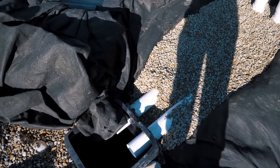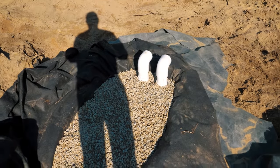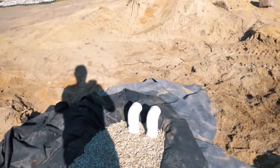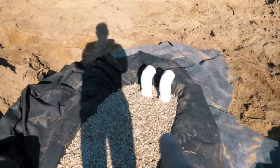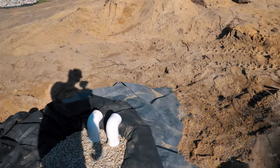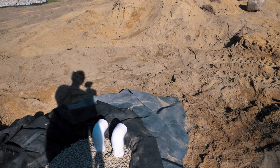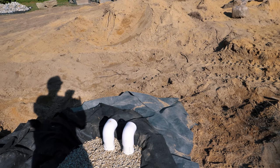This is going to be using external pumps — we have two EXT 12,000 pumps running the system, so we've got to draw the water from in here. We want to use hard pipe because on suction you could actually collapse flexible pipe, so use hard pipe to avoid that. The reason we're putting check valves in here is because we have to actually prime these pumps — I'll get into that tomorrow. You can kind of see what the inner workings look like. We're bringing our pipes out, stepping up, and getting above our water line in the pond. Tomorrow I'm going to put a few blocks underneath there, four inches above water, so there's no chance of any settling, because those pipes can get heavy when they're vibrating and full of water.